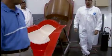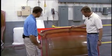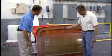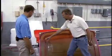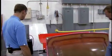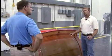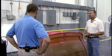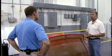Here's another part — this is a 370 trunk lid. This shows the bottom side of the top mold. These are your seals, and this is where the vacuum comes through. It forces this down to the stop point. Same theory: injecting resin, pulling it through the fibers, forces out the air. It consolidates all your layers and gives you void-free parts.